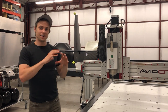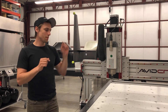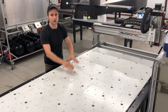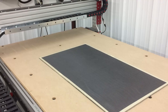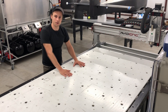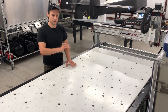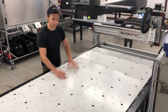Those are our top six reasons why we chose this router. Now let's talk about some small tweaks and upgrades we've made to get even more out of it. One of the first upgrades was swapping out the MDF table surface for HDPE. With MDF, humidity and temperature changes tended to swell the material, leading to inaccuracies from part to part. Swapping to something more dimensionally stable gives a lot more consistency in accuracy.